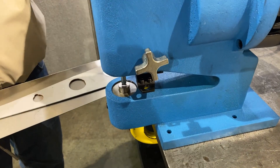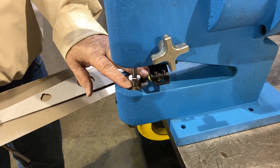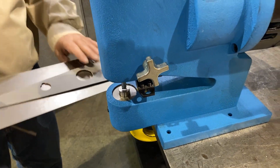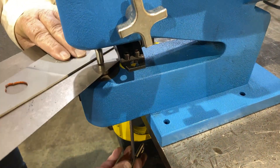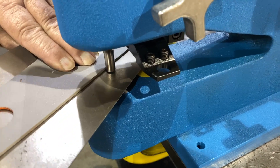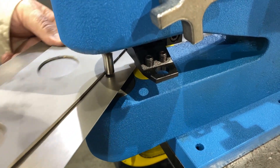The stroke length is constant. We adjust the bottom die button up and down for your material thickness. We adjust the gap so only one part enters underneath that punch, so we are guiding the template right on the side of that punch.